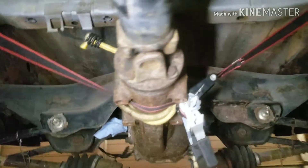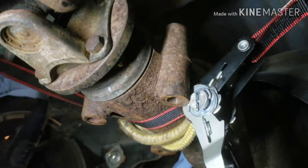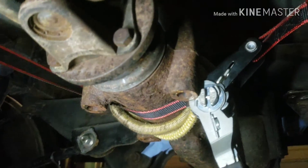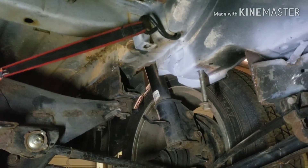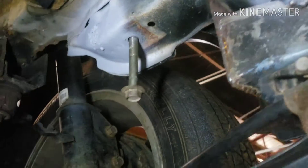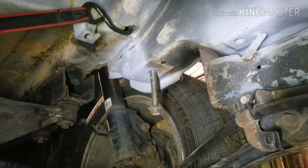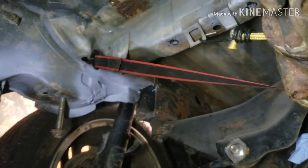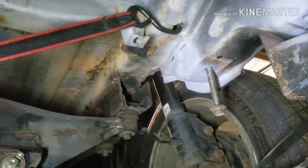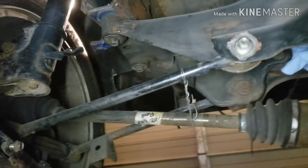Next I have to mount this rear diff. I don't know where these bolts are — the long ones that come through here. I do have the box that goes around it and those bars I showed you in the other video, but there's also a washer that goes up above the bushing that I don't have. I do have another Subaru parts car at my buddy's farm and I'm 95% sure the rear diff is all still in there, so I think I'm gonna head over there and try to rob it of some bolts and hardware, then come back and fab up this rear mount.